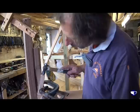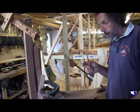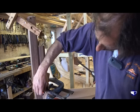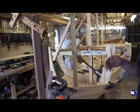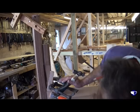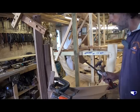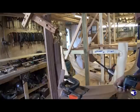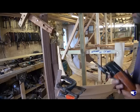It's handy here to use a piece of old plank cut away to sit over our half-lap and clamp that in place, then just use that as a bit of persuasion to get our plank down where it needs to go. The danger is that this top edge is going to get caught, so it always pays just to trim that away so it's not going to get caught and split — that's the most vulnerable part of the plank at the moment. This may not be a traditional boat-building tool, but I'm sure if boat builders had had them a hundred years ago they'd be using them.